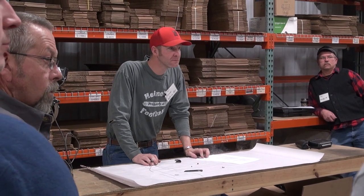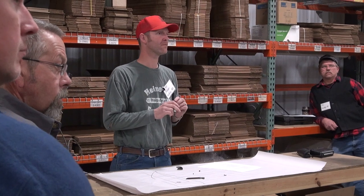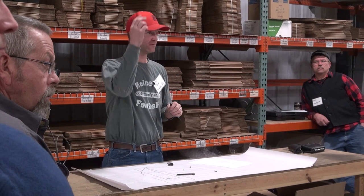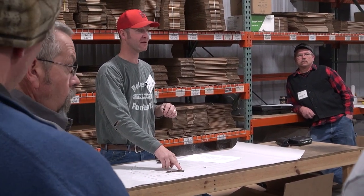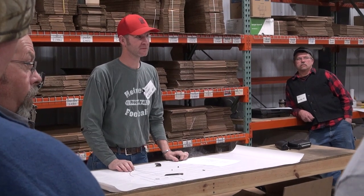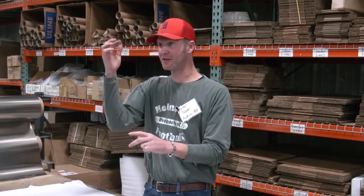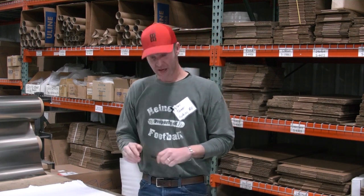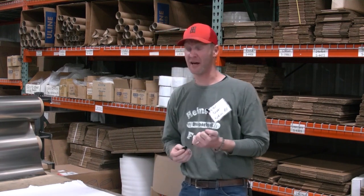Do you spot drill or center drill your holes before you? Because 55 is a really small drill bit. No, there will only be a center punch mark in the blade. At that point, you're going through the liner. That's going to hold your bit from walking and doing weird things. You're just going down and barely touching, and that carbide will dig in quick. So you're center punching the lock bar when you drill through your lock? Yes. Take a center punch and center punch that out.